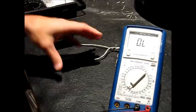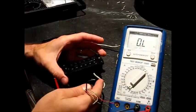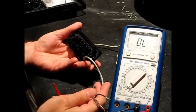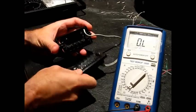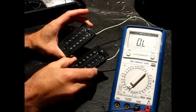Let me show you how to identify the wires, the coils, and the polarities of a pickup that is completely unknown to you, or you're not quite sure of, before you install it. What I have here to start with are a couple of pickups out of an old early 90s PV Impact Milano.